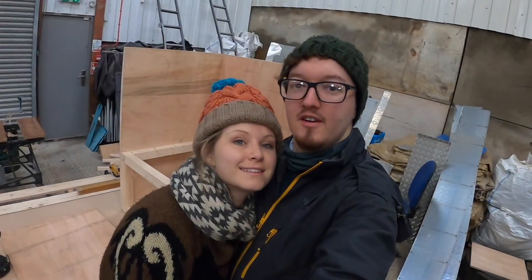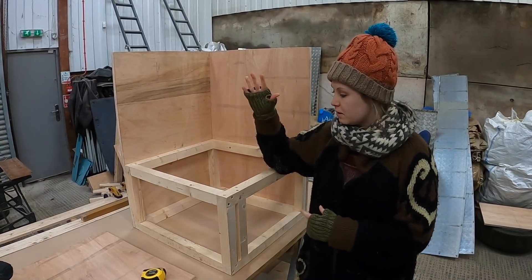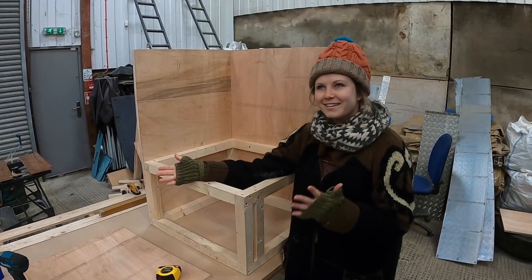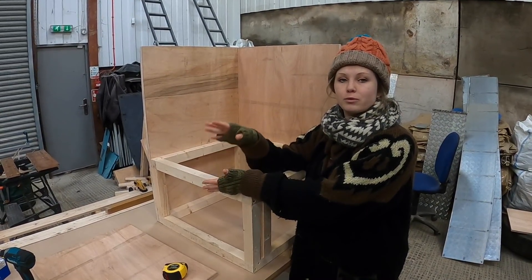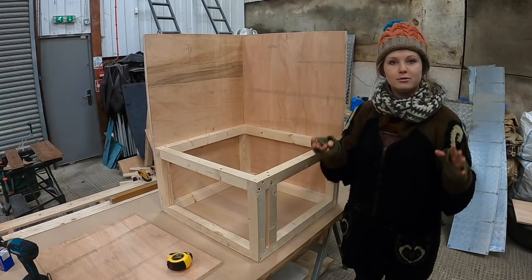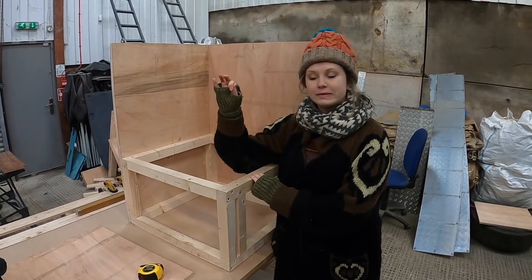We have to come up with some sort of design that can extend so that Max's big butt can fit on our sofa. Today we're back looking at our seating, and by the end of the day I should have somewhere to sit and eat my lunch. We ordered some foam and then realised the seat would be too small because the foam is too thick, so we need to recut the bases so there's a flap that extends the seat when in sofa mode. We also need the base to have a cutout for the table to slide in, and we need to fit extra beams for the drawer runners.